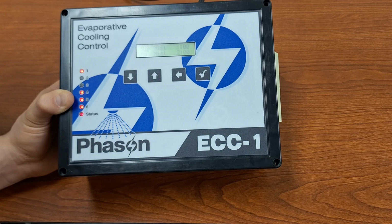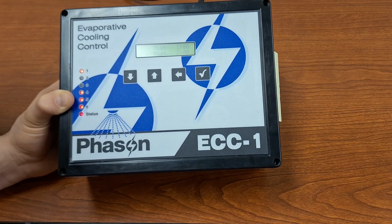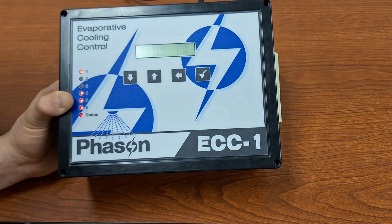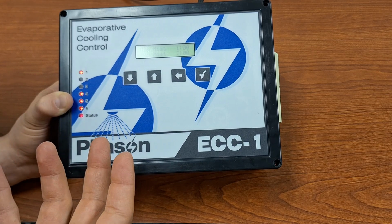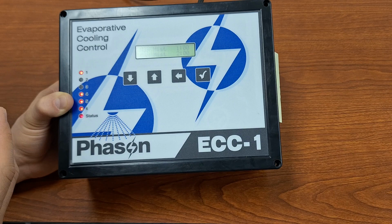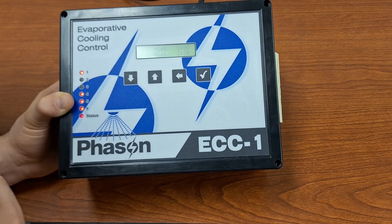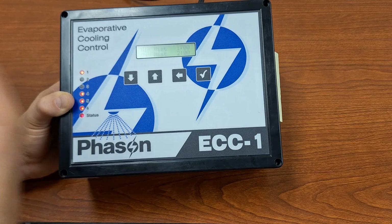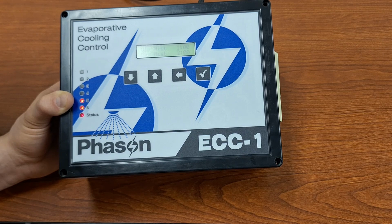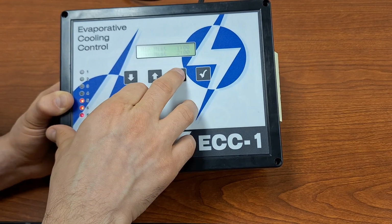And then using the same example, if we're at 85 degrees, halfway in between, we are going to be halfway in between for our misting duration. So that's going to be 1.5 minutes. So we're going to have 4.5 minutes of misters and then 11.5 minutes of just the fans to finish off that cycle. And then again, checking the time, looking to see what it should do. And then again, checking the temperature and seeing what it should do.